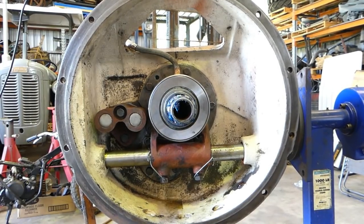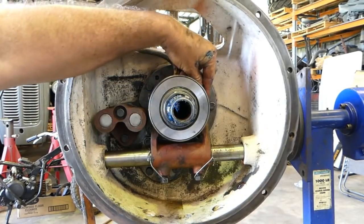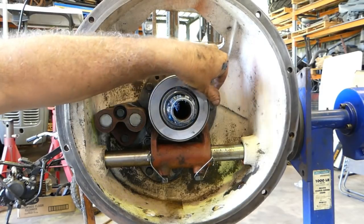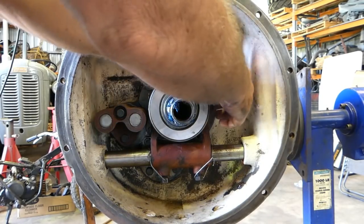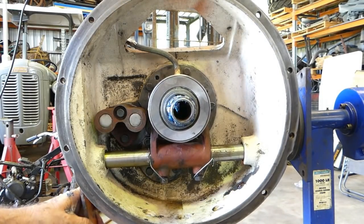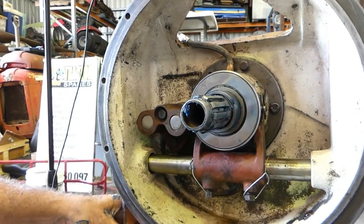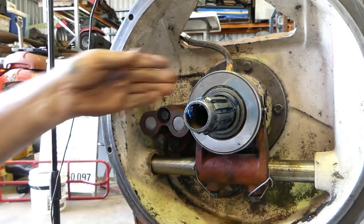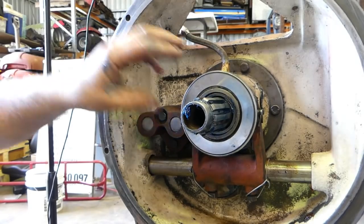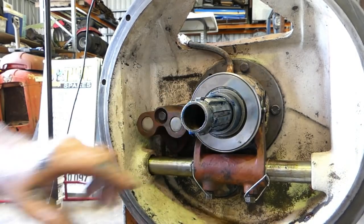Now on these little chambies, they have these little spring clips, and the spring clips pop on the little tits like that. Have a look at this one. I can't feel around in the dark. So now those little springs help it go back and forth on its own. So when we get you around the side there, you can sort of see how that goes. Now the top cover here, some of the top covers have a hole in it for this grease tube, some don't. I'll probably leave that off so Paul can, when he's lining the clutch up, give it a bit of a rattle around in there if you choose to.